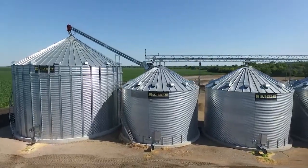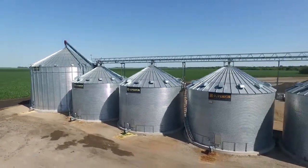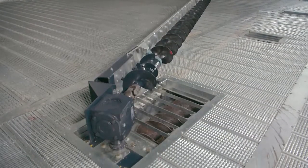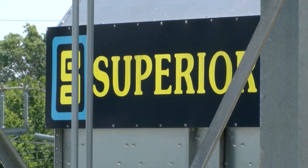A trick that a customer told me years ago that I still tell everybody to this day, and I've had people call back and say I can't believe it, but it worked, is you wire the motor on the unload backwards and you take the top off your accessible area outside the bin and put 3 to 4 dozen golf balls in the unload. You run it backwards, and when it gets to the back, it'll build up that clump of golf balls, and it'll sit there and hammer at that clump, break it loose. Shut it off, run it out by hand, close your gate so you're not augering more grain in there, and then you get those golf balls out of there. Who'd have known that golf balls could save lives?